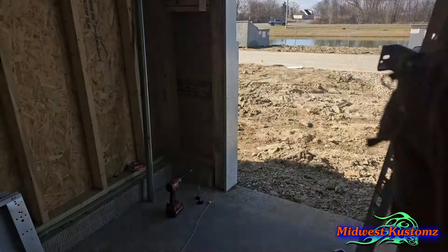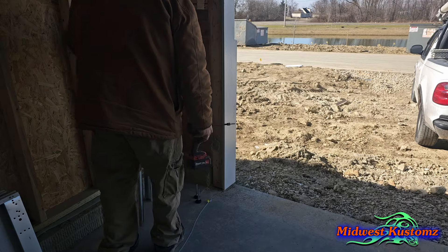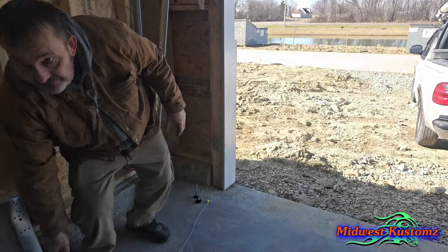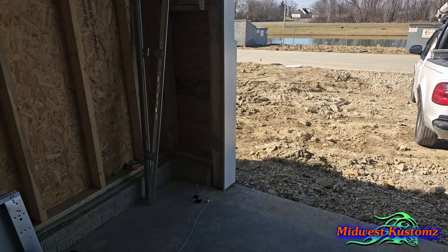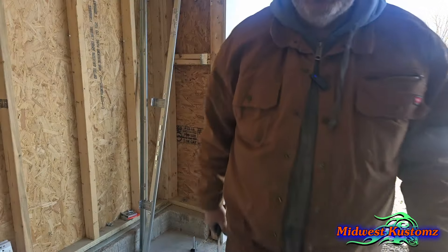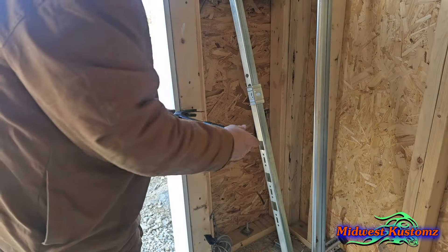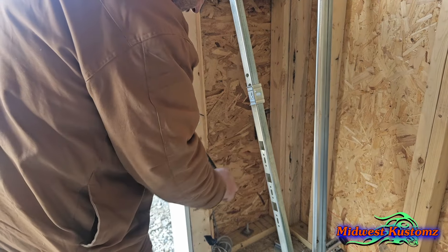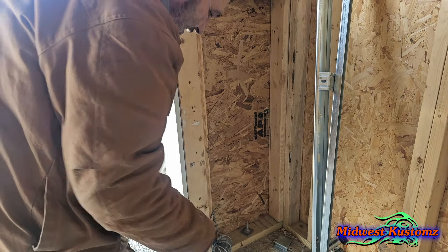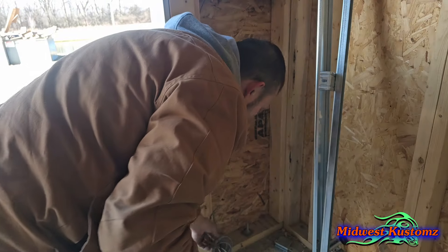Break them up and get these on. I put my right one over here and pre-install the left one. Oh wait, I'm moving along too fast — I forgot to go around and get all the nails out. I'm going to go around and take all the nails out real quick. On these nails, the easiest way is to stick your hammer in there and go sideways — it pulls out much easier because they have shanks in them.